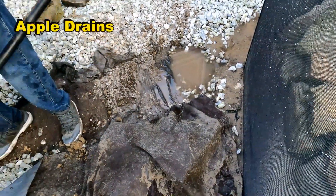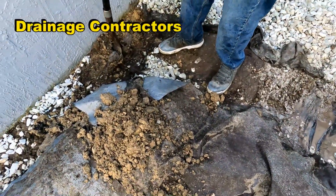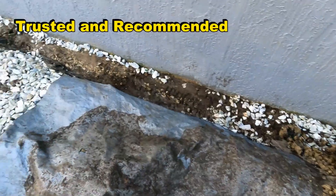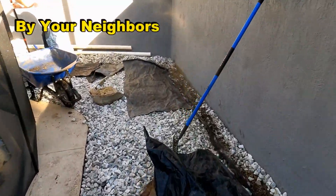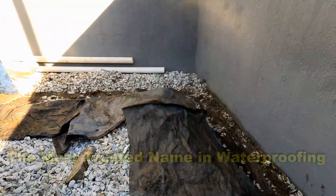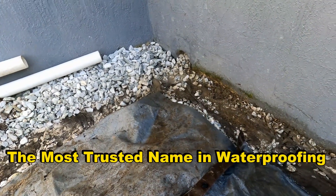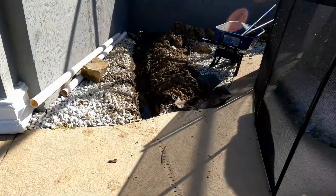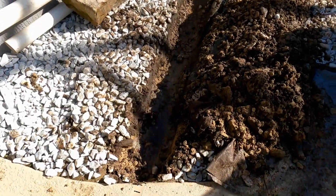We need to have drainage from the end of the channel drain, so we're coming straight over to the wall. We're going to take this pipe and go down the wall. This is just three inch line and it's going to discharge right over here at that six inch opening. It might be a little high but we'll check it out. If it is, we're going to core some holes in this wall to allow drainage from this area. Okay, you can see they got this opened up — looking good. Water will drain from this side without any problem.